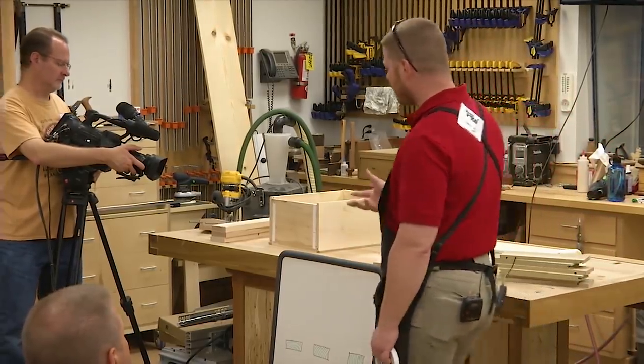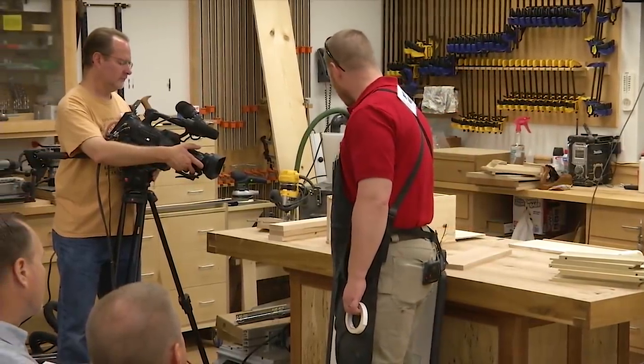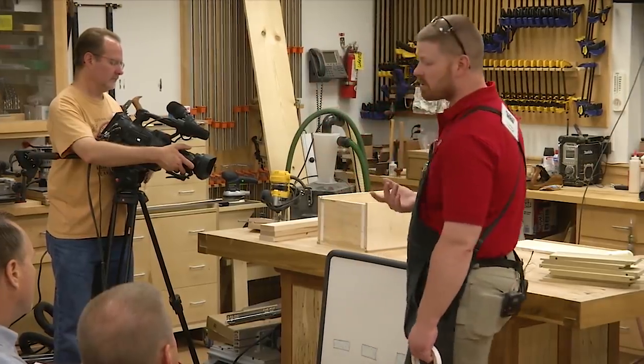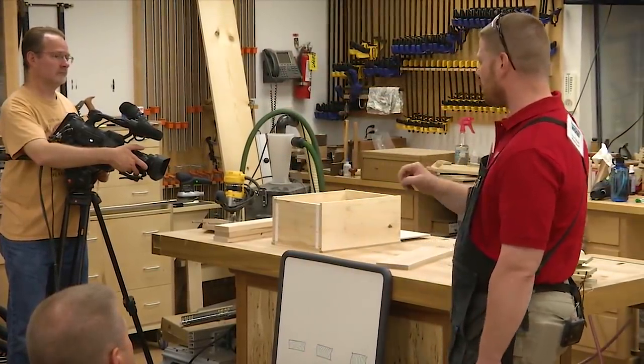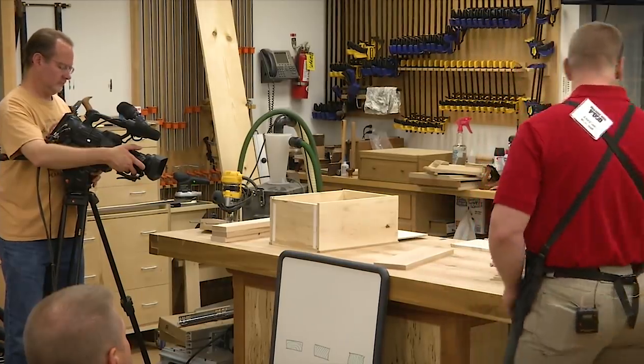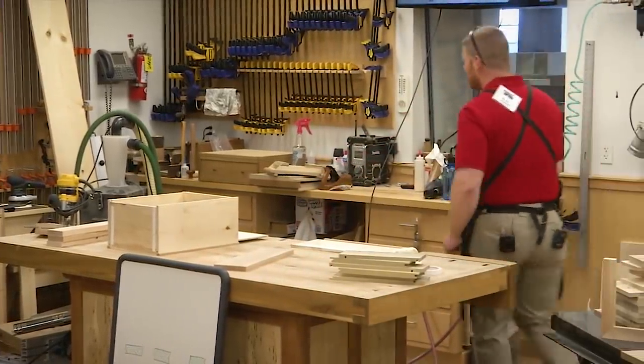Typically, on a big drawer, we'll actually screw through this into the false front, so we'll screw them from the back into that. On a smaller drawer, you could probably get away with just drilling whatever holes you want for hardware and attach it that way. And that's how these guys were done.